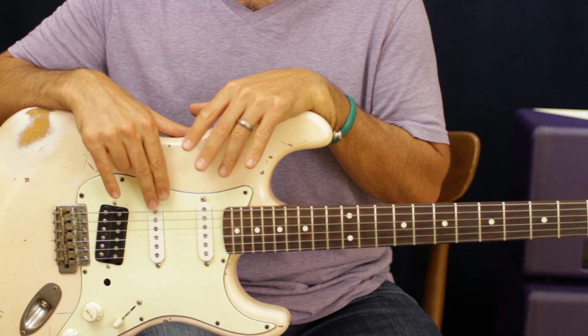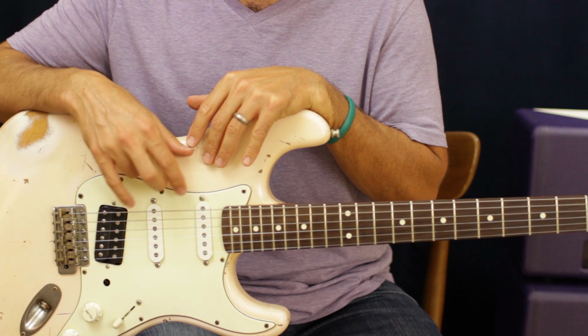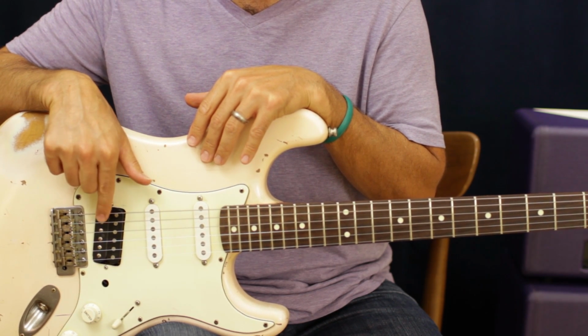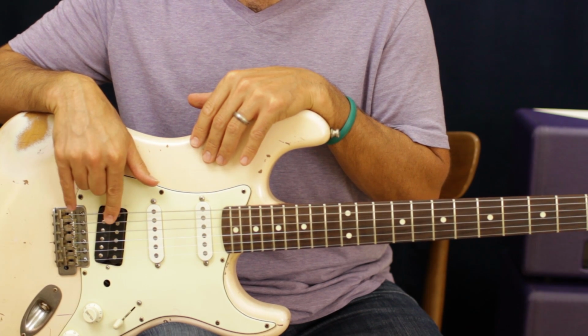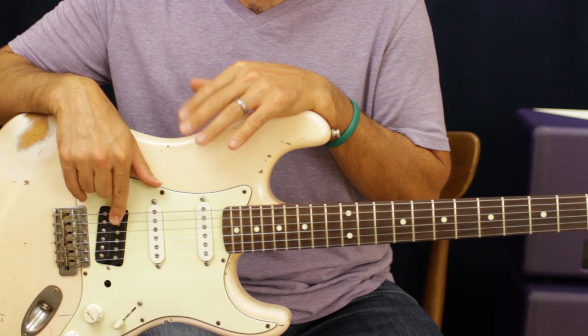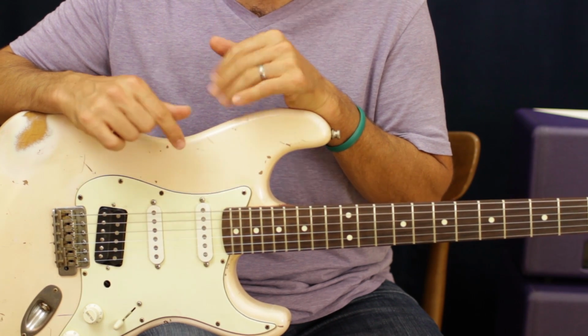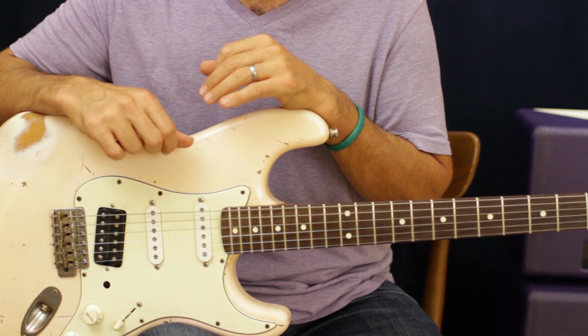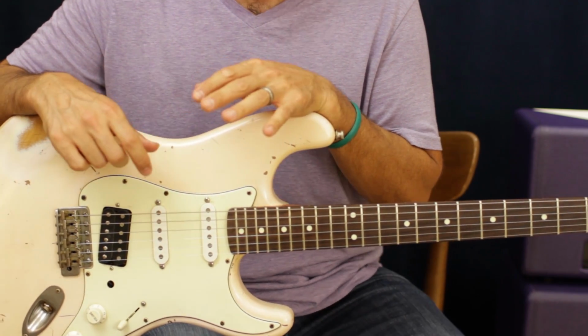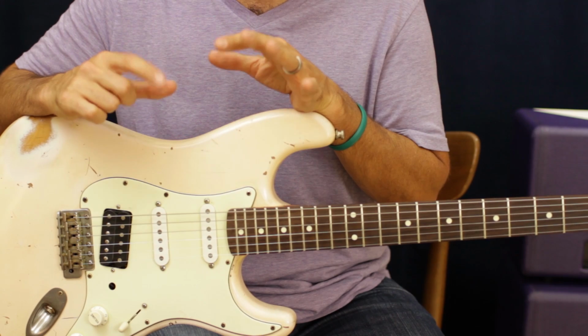So they're the S series, right? Those are single coil, for all you who don't know. And what's in the back here is called a humbucker. What's cool about the humbucker is that single coils can be noisy. You know that noise you hear when you plug in your guitar and you're like, what is that sound? And as soon as you roll off your volume knob, it goes away, right? Single coils are hum inducing.